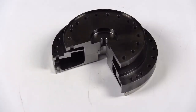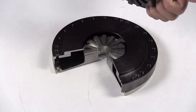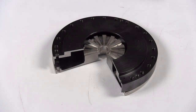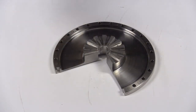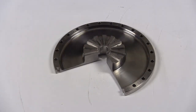What we have here is the Riverhawk coupling. A significant advantage of the Riverhawk coupling is if the guard gets damaged, it can be removed because Riverhawk uses a proprietary spline feature that connects the flange and diaphragm versus electron beam welding. So if the guard is damaged, you can disassemble the coupling, remove the guard, install a new guard, and have the same coupling versus doing a complete replacement of the coupling.